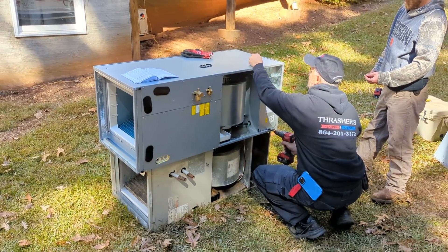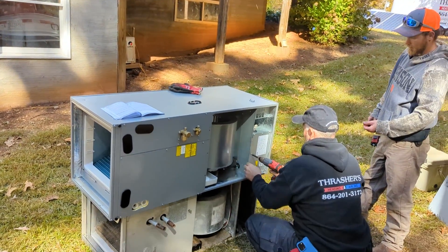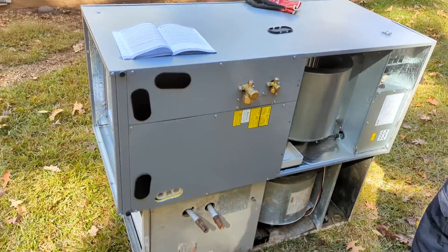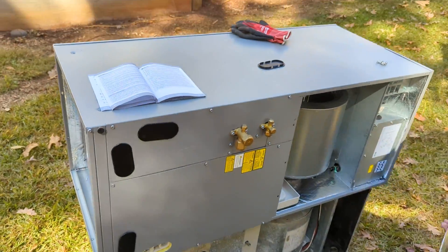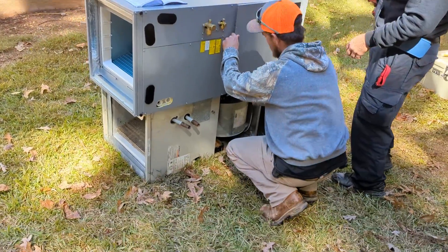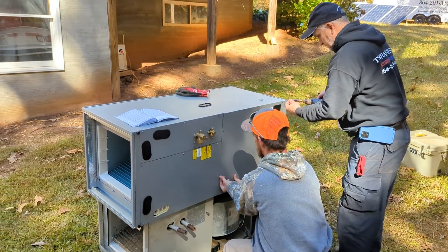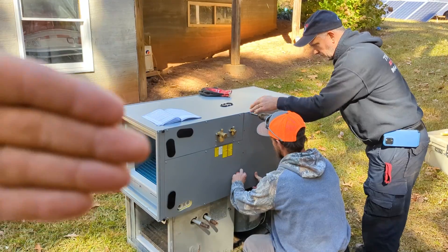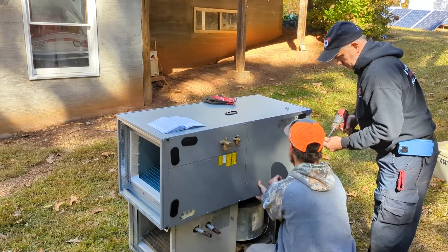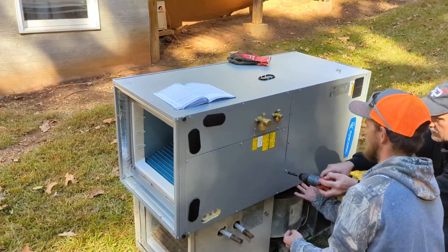Both Tony and I sell MrCool now, and he's a Trane dealer and technician — that's his favorite. But the MrCool has worked out really well because of the pre-charged line sets, which I think are cool. What we're doing now is preparing — we took out the old air handler that's been in my house for 20 years, and we're putting in a new MrCool air handler. It can be set as three-ton or two-ton via dip switch, and the same with the condenser unit. We're going to put in three condensers and a couple of air handlers in my crawl space.